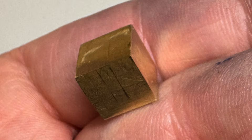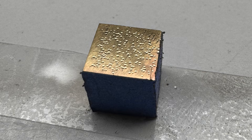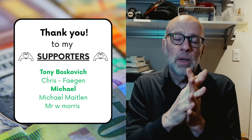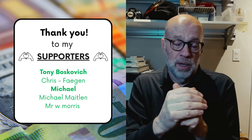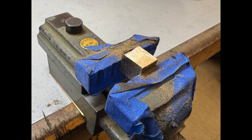The next project was machining a 10mm square brass cube and applying different finishes on each side — six finishes total. This was using hand files and an India stone. I was surprised by how much I enjoyed applying the finishes. To date, I've been more interested in movements than in dials and hands, but learning to perfect different kinds of dial and plate finishes could be a lot of fun. But half of my finishes didn't pass muster, so I earned a 50 out of 100 grade. Now I'm making another one after class hours in order to raise my grade.